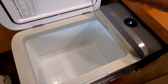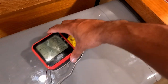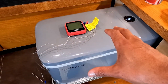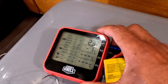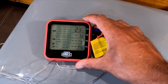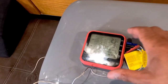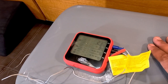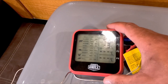Definitely going to store my ice cream in here. Now I'm going to close the lid, put the thermostat back in, set everything back to five degrees, and time it for another five minutes to see how long the cooler retains its coolness. Everything is pretty much settled — it's now at minus one degree. After opening the lid a lot of the cold escaped and filled with hot air, so it took a bit to settle down. After about half an hour it has settled at minus three degrees, so I'm actually really impressed. The insulation definitely retains a good amount of coolness keeping the heat out — it's 23 to 25 degrees outside, so that's a good 20-plus degree difference.